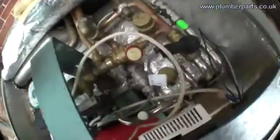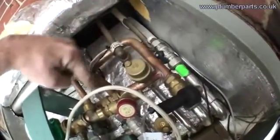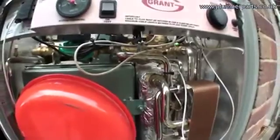Now let's look at where the heating water goes. The heating water comes out the top of the boiler here — it can either T off to the heating system this way or into our heat exchanger. It comes down into the pump, pumped into the bottom of the 35-litre heat store, then it comes out of the heat store at the top, goes through the plate heat exchanger, and goes back out to the return of the boiler — just like that.